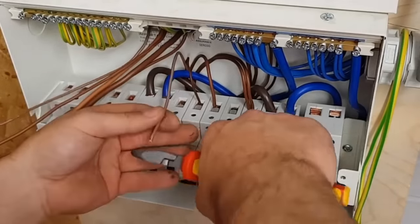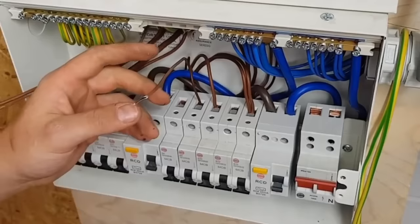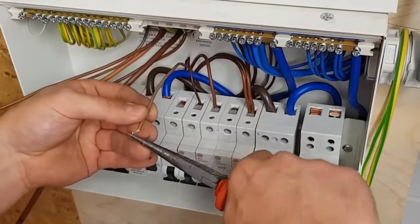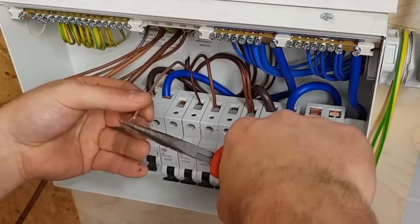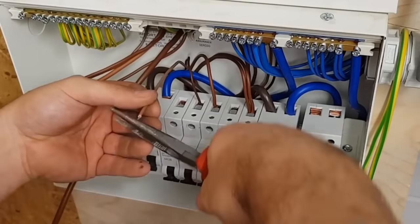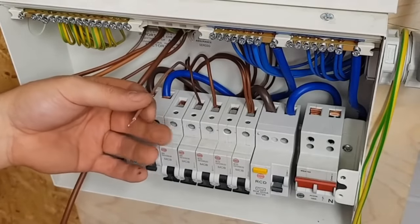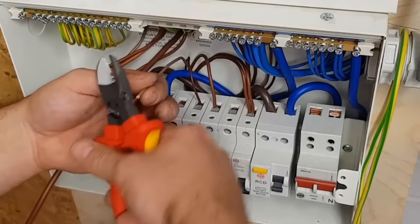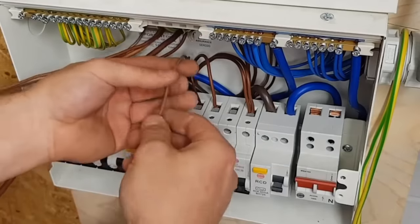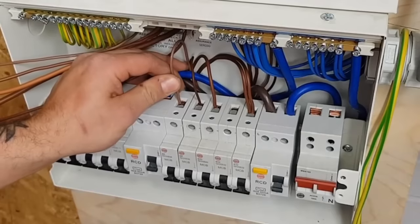For the learners then, as we're looking at it, the right hand RCB that we're currently working for, the circuits for, this is where Luke suggested that we were mixing a ring main circuit, say from downstairs, with a lighting circuit from upstairs. So in the event of losing an RCD or an RCCB in this case, we're only going to lose part of the electrical circuits in the location you're in. So you might have the sockets in your area go off but the lights are on, or you might have the lights go off in your area but the sockets go on, meaning that if you lost power in the dark, things that give residual light out, such as TVs and computer screens and monitors, will help you. You won't be plunged into complete darkness when you've lost that circuit.